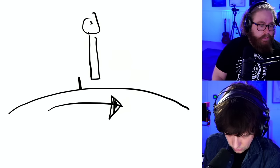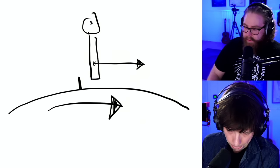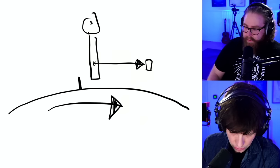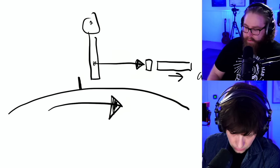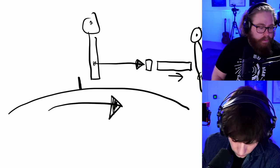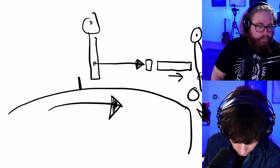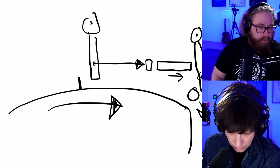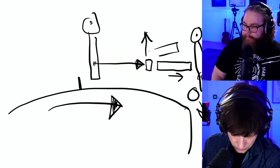There's the registrator. And it's just pushing, which is a mechanical and much more difficult thing to do. So this is the pusher, and here's the connection. And when it gets pushed, a note is played down here somehow. The pivot is here and it's just opening the gate. So here's the marble, and the marble falls down. Then our beautiful muting, the way we muted it, is that we're just lifting this thing up. So this thing instead pushes on top of here. This thing is lying in a track.